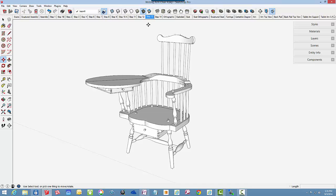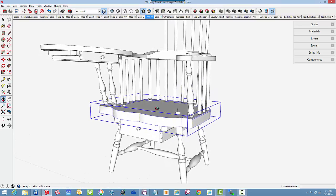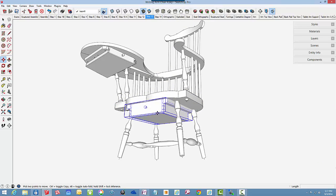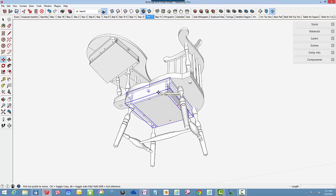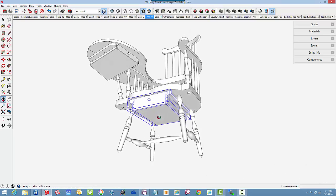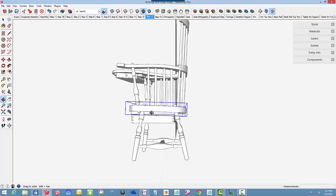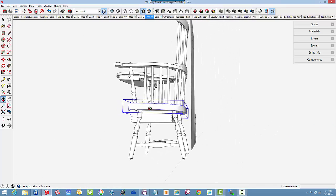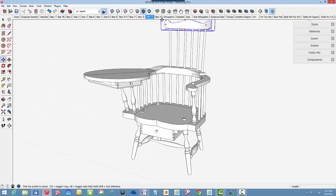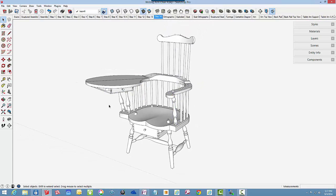The last piece assembly has been added now, and that is the seat drawer assembly. Again, there are drawer guides on each side with tongues running in the grooves of the drawer sides. They're all dovetailed together, and the drawer bottom has tongues into the sides.